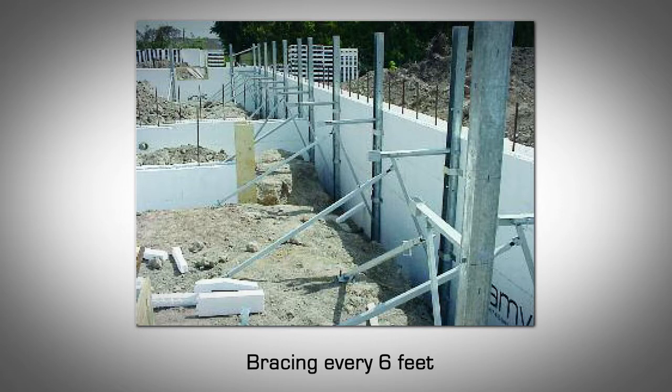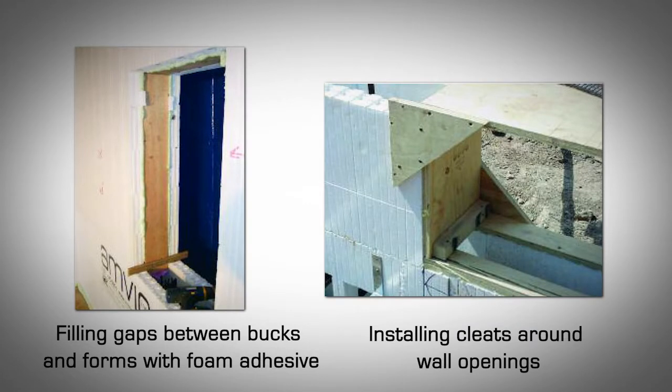On walls that end without an adjoining corner, stub walls, install braces on all 3 sides. On T-walls, install at least 2 kicker braces on the outside of the T, the top. This is because walls tend to bulge at T-joints due to the pressure from the concrete in the leg of the T.